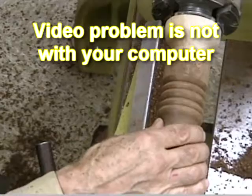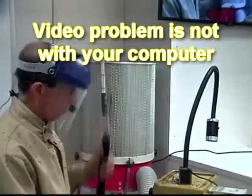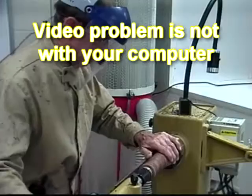That's three eighths, or maybe a 5/8 spindle gouge, I'm not sure. You could, but it's more blunt. That's a 50 degree angle versus 45, and it's hard to get down in the bottom of a bead without getting a catch. I'm going to take that bead off too right away. Make it a little longer in the middle.